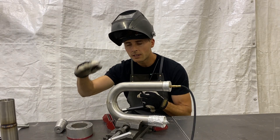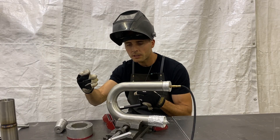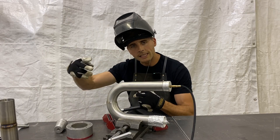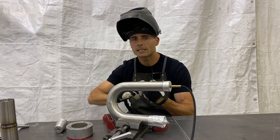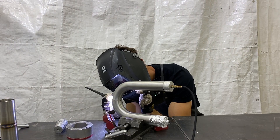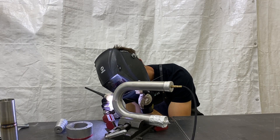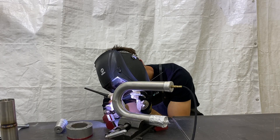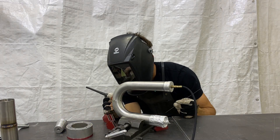So right there, a couple different times on that stretch, it would kind of start doing some funky stuff and I'd lift on the pedal just a hair. So I started max pedal, waited, started ripping — and when it started getting a little funky, I'd just lift a bit and let that electrode come back into a consistent shape. Max pedal — 12, 13, 14, 15.